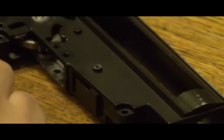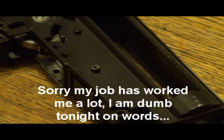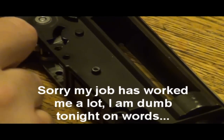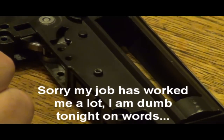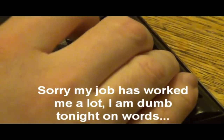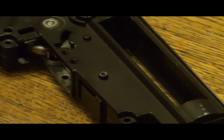What was I going to say? I forgot. Oh, tightening. Especially if you put in different types of anti-reversal latches, they are different sizes. They could be wider, so if they're wider, they get stuck in the gearbox shell. They can't move freely, and you have to do modification to the anti-reversal latch or the shell.